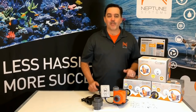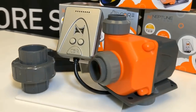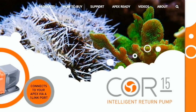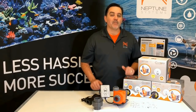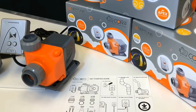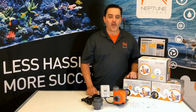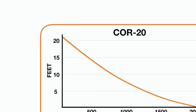Terrence here again from Neptune Systems, this time to introduce you to our latest product, the Core. The Core is a return pump that's available in two models, the Core 15 and the Core 20. And while much is the same between the two models, this video is going to focus solely on the Core 20. The Core 20 is a DC motor-driven return pump rated at 2,000 gallons per hour. It uses less than 90 watts of power at the wall and has a maximum head height of 21 feet.